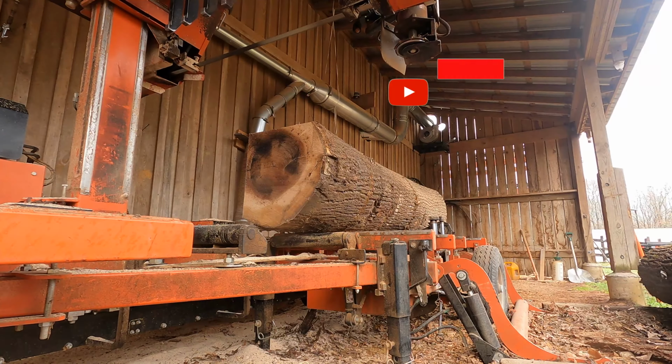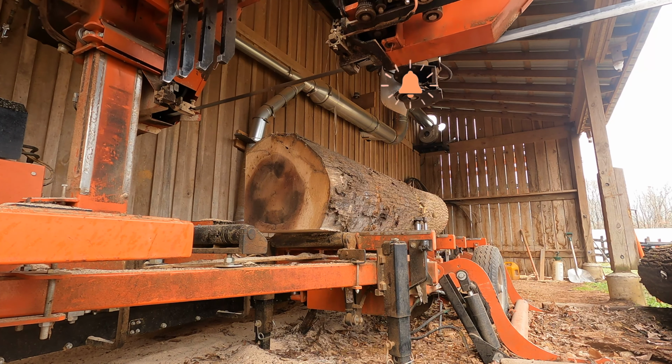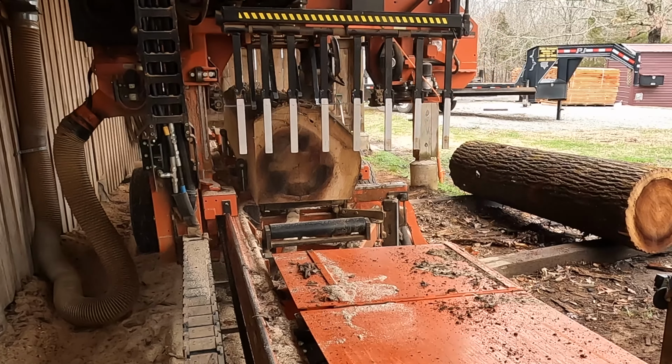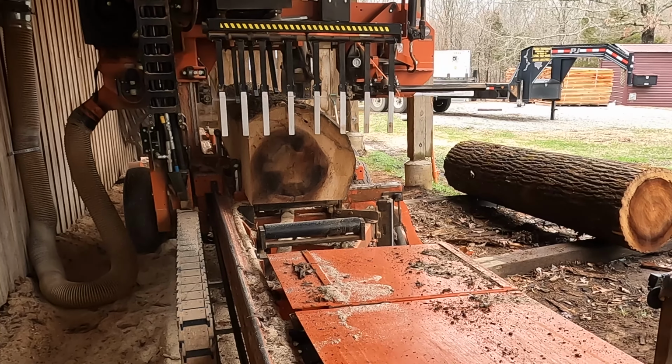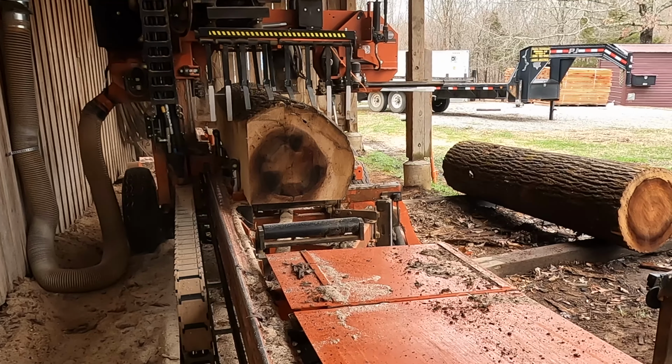Now I'm going to rotate these sides down, and I'll be parallel bark sawing, so I'll be able to get a good, straight, clean cut parallel to the top of the bark. I'll show you what I mean. So I may have been wasting wood on the top cut, but you'll notice that this cut is right down the bark. It's going to be an excellent, perfect cut. See, look at that.